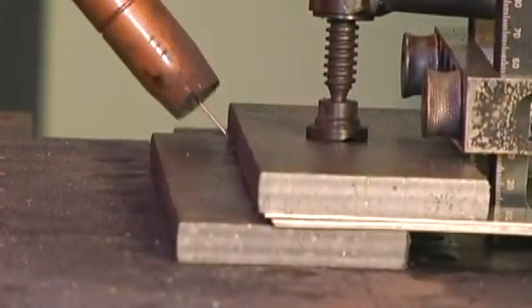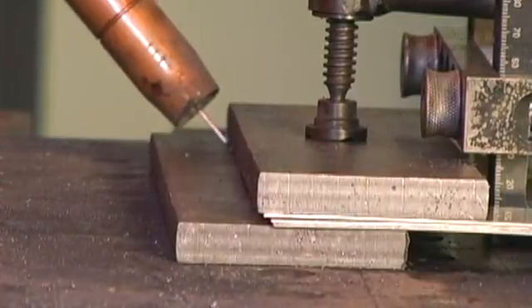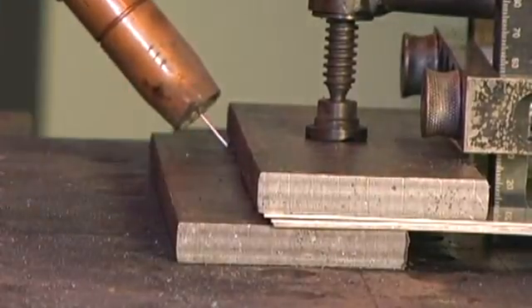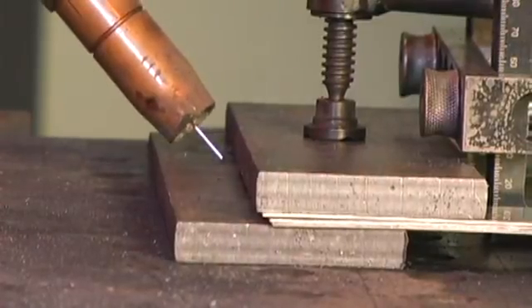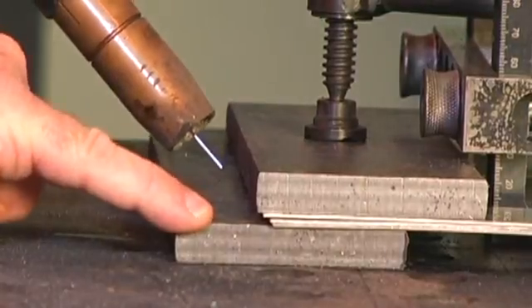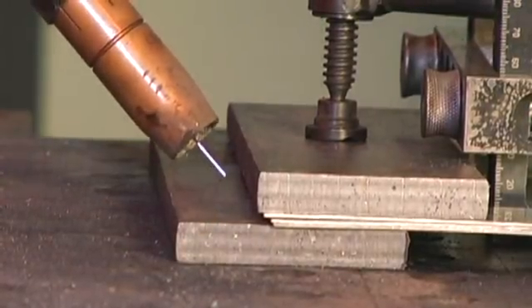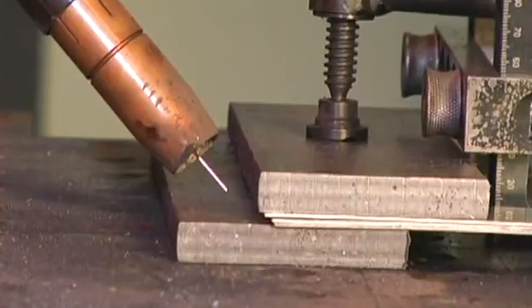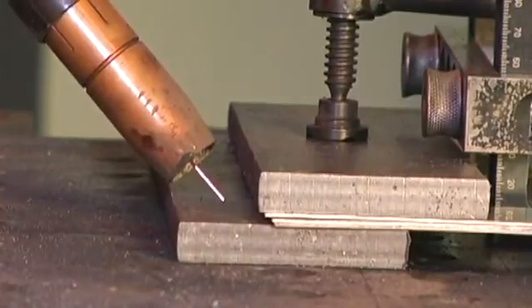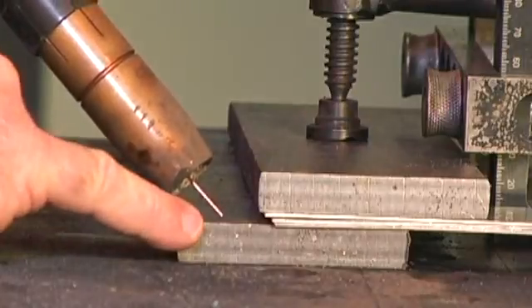What we have here is two half-inch plates. There's no gap at the start of the joint and there's a 4mm gap at the end, as you can see. We're simulating the tracking at the moment and it's actually going to the programmed point, which is about half an inch out in fresh air, not in the root of the joint itself. In a minute we'll be switching on the arc and the tracking will begin, and the impedance will be controlling the arc to keep it into the root of the joint.